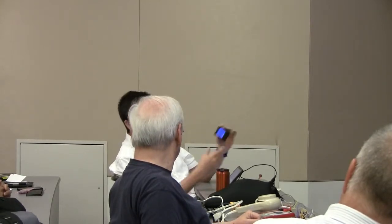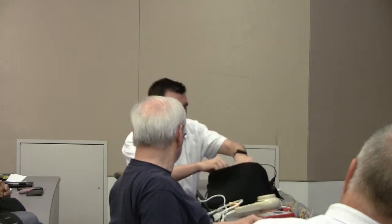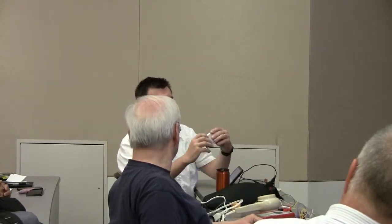And how many analog and digital channels? This one has two analog channels and a wave out. I have one that I bought a few years ago, an earlier model. It's got a really quirky interface, but it's got 2 analog and 2 digital inputs and a wave out. And the cool thing is I've replaced the firmware on it. The firmware that came with it kind of stinks, but they open sourced it, so a bunch of people improved it and made their own. The chip they used had a lot of extra flash space, so it's divided into slots. I have several different firmwares I can boot by pressing different buttons.